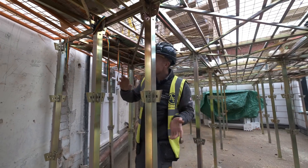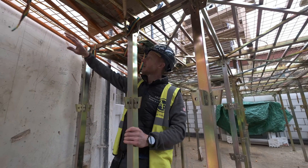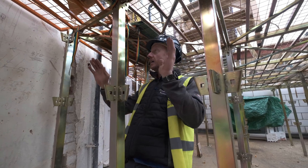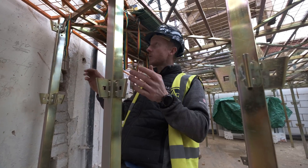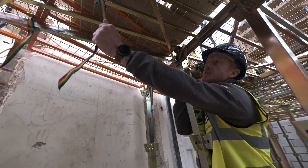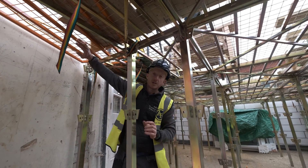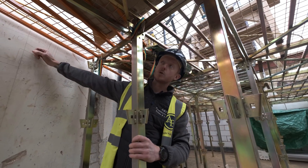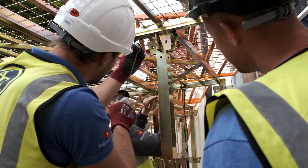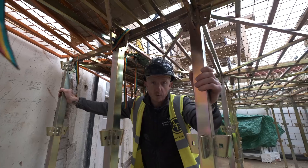We've built our main framework up and then we've got these filler panels here. These orange panels are filler or bridging panels — they act as a filler because the panels are square but the area we're going into isn't square. We can use these panels to go across those areas and then use our cam straps here to tighten everything up and make sure it's all nice and solid. These are also used as tensioners — they go butted up against the wall and a special formation with the cam straps pulls everything nice and tight, butts it up against the wall and keeps it solid with absolutely no movement whatsoever.